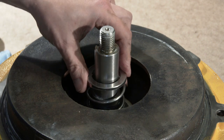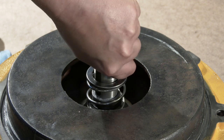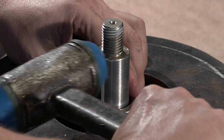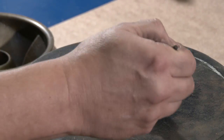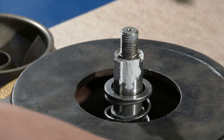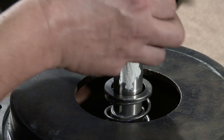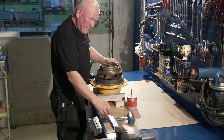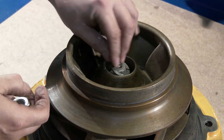Place the spring. Fit the sunk key in the shaft. Lubricate the shaft end and lead the impeller towards the shoulder of the shaft. Take care that the ring at the end of the shaft seal spring locates in the recess of the impeller. Secure the impeller with washers and nut.